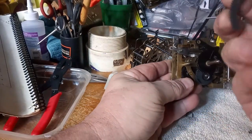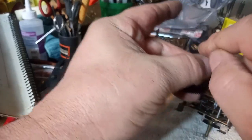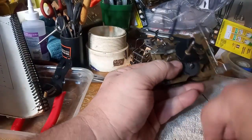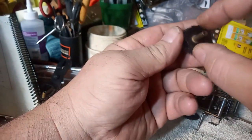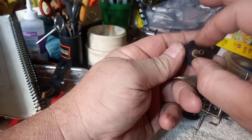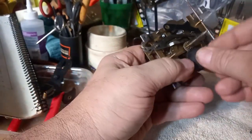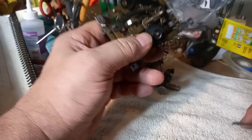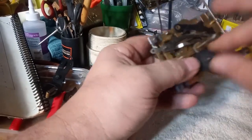Again, this is the rack. When you clean it, take a toothpick and clean all the gunk inside that hole to allow it to drop freely. The snail is what the hour wheel — the hour hand — fits on. This is called the minute wheel with minute pinion, and it is held in place by an E-clip. This washer is what holds the snail down onto that shaft; without this washer, the snail will slide up and down.